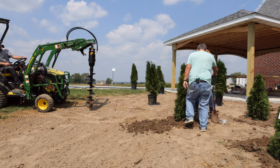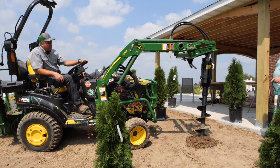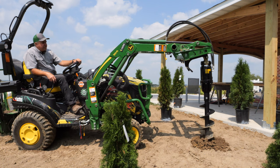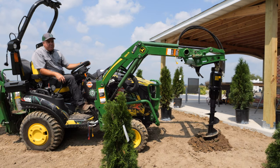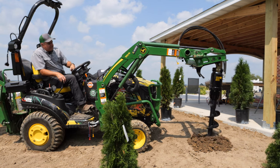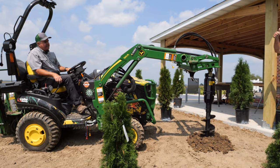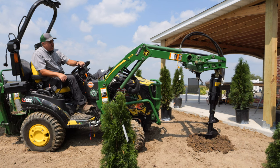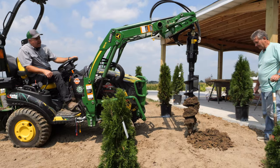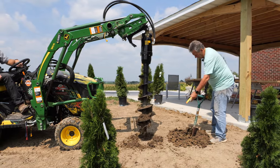Best one so far — it really fell right down in there. I'll try this on a stock 1025R sometime around the house just to see. It says it's rated at six gallons per minute and obviously a stock 1025R does not have that. It's much handier to use than a three-point post hole digger. The biggest reason is it will turn backwards — I can stop it and run it backwards or forwards. This attaches to any fork frame, so if you've already got a fork frame, that's the best way to go. Kevin wants you to run it off to the side, and I can see why — that improves your visibility a lot.